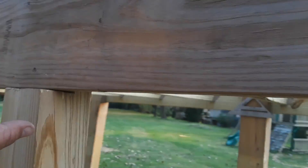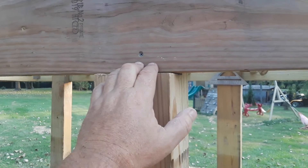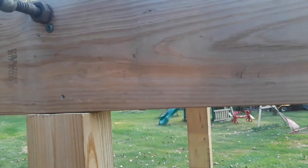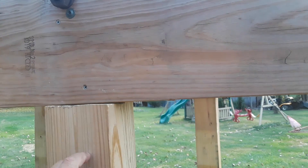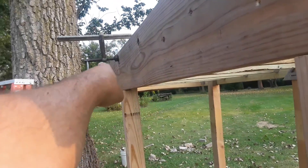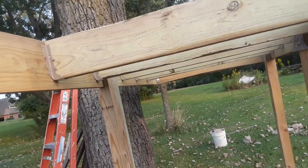I'm going to sandwich another board on the outside of this — this is a two-by-ten by ten, and I'll have another two-by-ten by ten on top of it screwing into that. I'll have a little bracket that comes out and screws in like I said earlier, offset at that angle. The way this treehouse was designed, I was going to build it more into the tree.